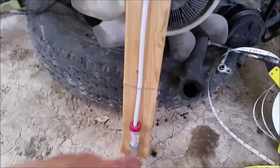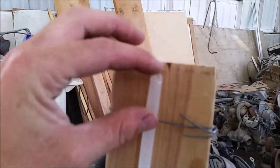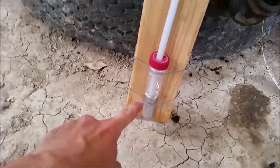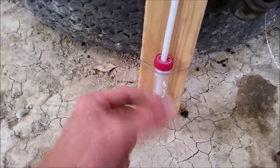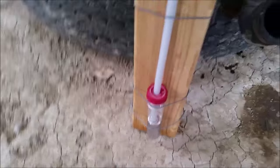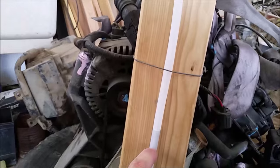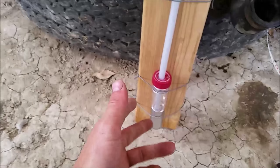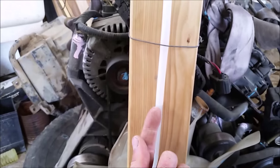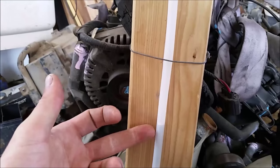This is surprisingly difficult. All right, it took quite a bit of flapping around, but I finally got the mercury barometer to work. I had to seal the top a little better, and I learned that the bottom needs to have a smaller opening so that the mercury doesn't run out when you tip it over, which will of course suck bubbles back up through it. And you don't want bubbles in here, because I wanted to have a near perfect vacuum above the mercury. That way we're able to accurately measure the air pressure, because the pressure here is forcing the mercury up, and however high that goes is how high the pressure is. If I have air up in here, then it'll make this go lower.